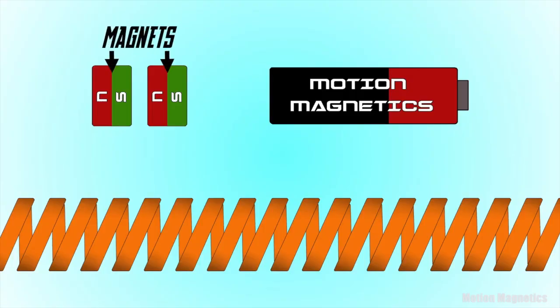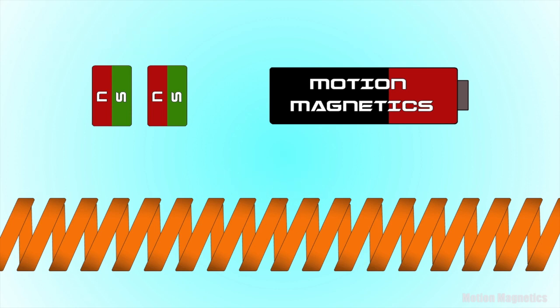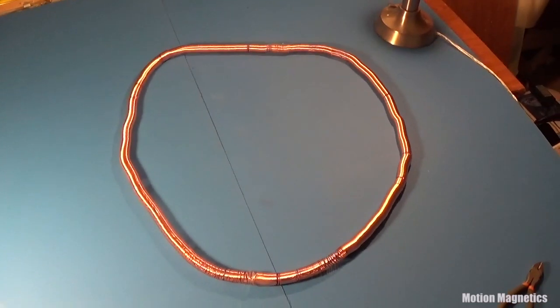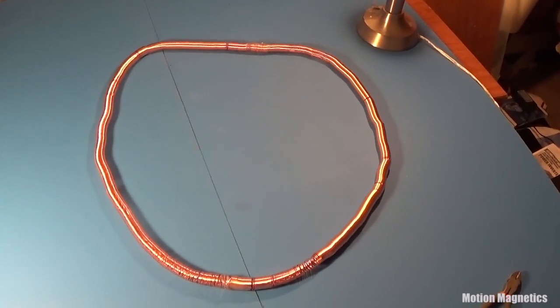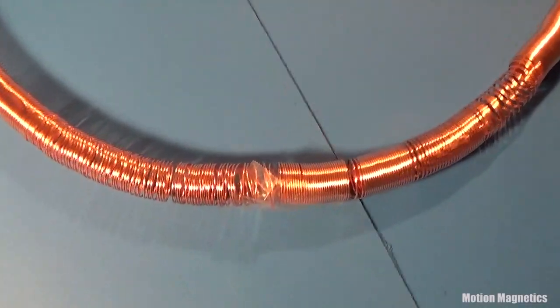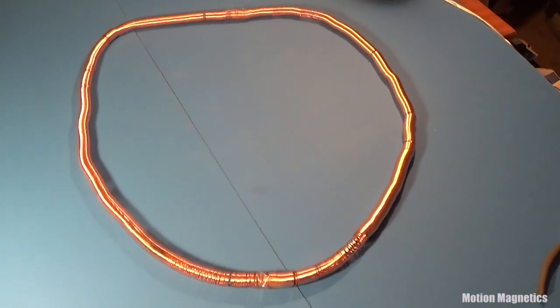This simple chart demonstrates how these three basic things are oriented to make this work. The magnets on both ends of the battery create a complete circuit when in contact with the copper wire. Electrons then flow from one side of the battery through the copper wire and into the other side of the battery. Make sure the magnetic poles are facing each other as shown in the diagram or it won't work. I also used a small washer on the AAA batteries in order to keep the magnets from slipping off the positive end of the battery.